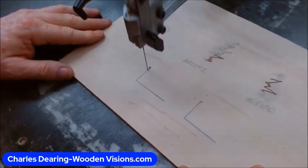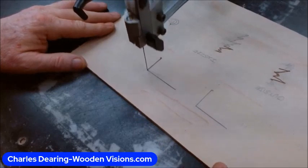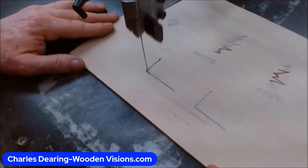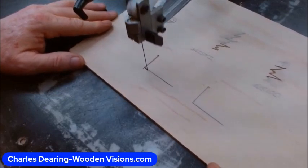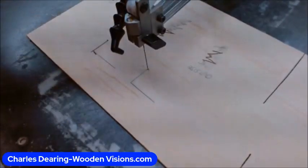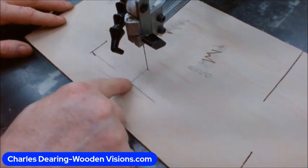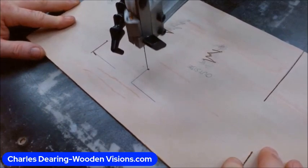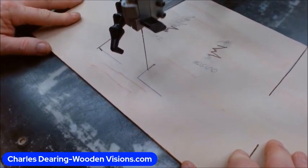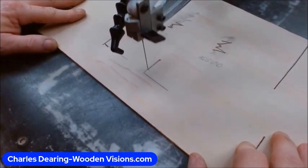Now we're on the waste side of the line — I just didn't shade it in. If you want to, you can come right up to that corner ever so slightly faster since it's a waste area, and then just start cutting the other way. You can do it that way, or you can come past it and come back to it — that way you have something to calm your nerves. You definitely have to be more careful on an inside corner, because if this is like a decorative part of a box, this is the waste area — we don't want to damage the other side of the line. You want to be more careful coming up to that line. This spiral blade will not cut any faster than you're pushing it into the blade and won't cut in any direction you're not steering it.